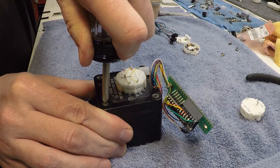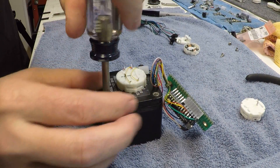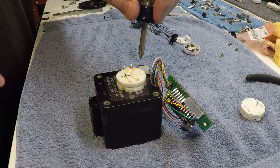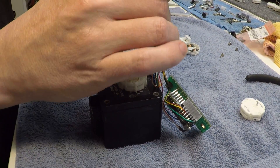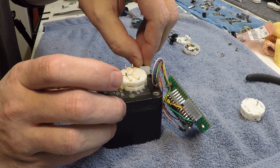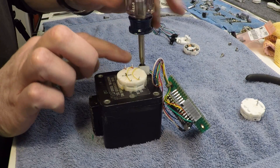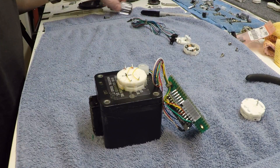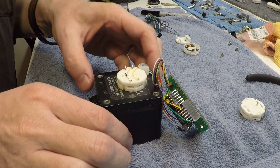We're going to go ahead and take it apart. Take some screws out. On the back here you'll see a stepper motor. These are typically used in automotive applications for your speedometer and RPM gauges and things like that. What I've done is modified it a little bit — I've removed the stop inside the motor so it can do a full 360-degree revolution. This is a 720 steps-per-revolution motor, so mathematically it works out nice: you just divide it by two and you've got 360 degrees per revolution.